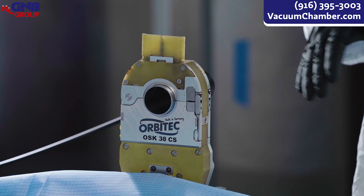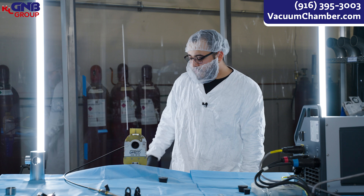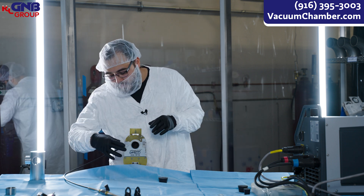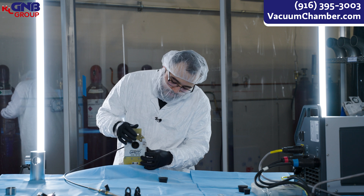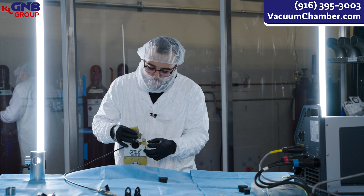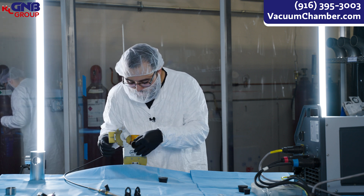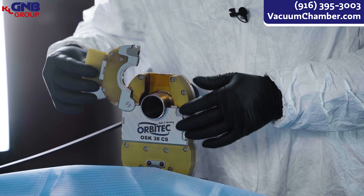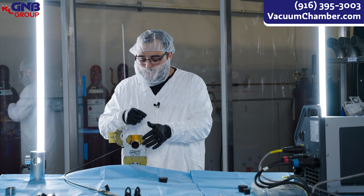The process we're doing today on orbital welding is TIG welding and we're going to be using 100% pure argon. The way I have everything set up is that you have two sets of clamps. You're able to open one up and set in your part. This piece comes out and you butt it up to the part you have in here, then you line it up to where the tungsten's at, and that tungsten will go around the whole thing and weld it.